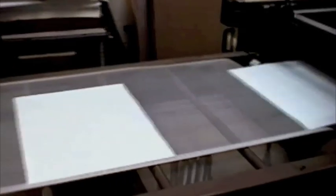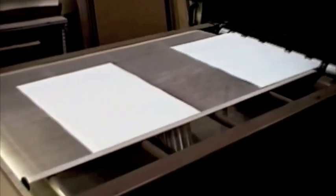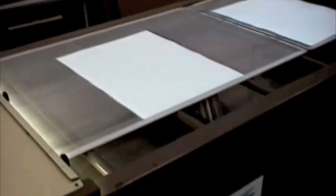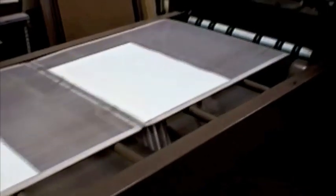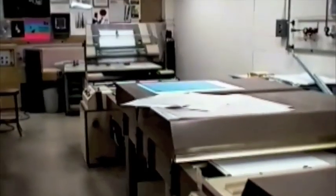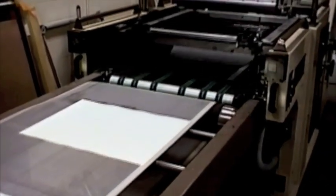The air in this lab is very humid today — there's no air conditioning here. And because of that, the paper has absorbed quite a bit of moisture. When it goes through the UV curing and the dryer, the dimensions of the page change. So what we're now doing is running the paper through the press without printing on it so that we sort of pre-shrink it, and we will then take that paper and run it again through the press to maintain the same dimensions through each of the passes.